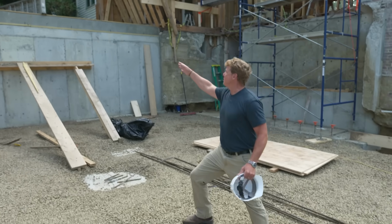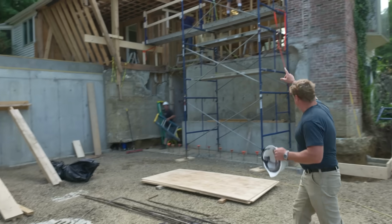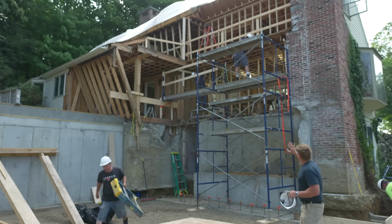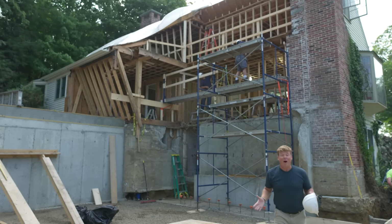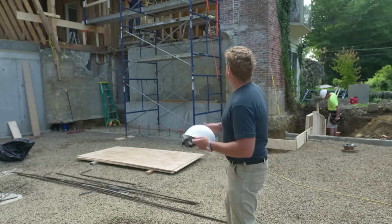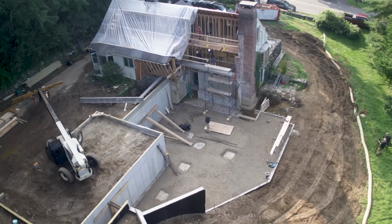to be holding the beams that hold the first floor of the addition, which is going to be tied into the original house. And off the back right there, that was the old living room. The back wall has come off. There's going to be an opening to the new addition, and as is the case often these days, the homeowners want an open floor plan. So that means there has to be a big beam to clear open that space right there, and that's going in today.